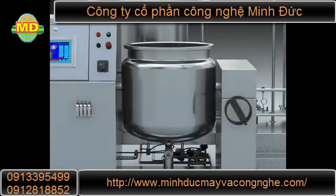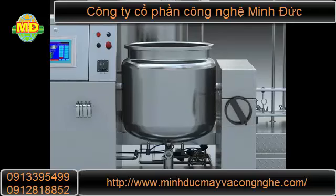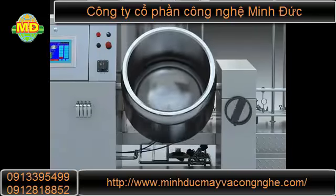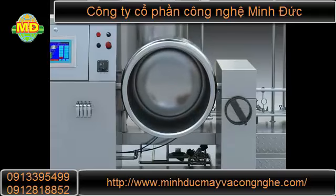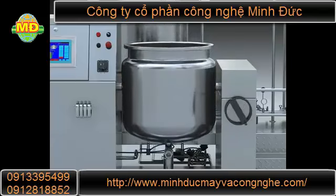4. Discharge system. It is made up of discharge handwheel, worm screw, worm wheel. When the emulsifier gets to the upper limit, forward swing the discharge handwheel until the tank leans to the point that the upper is lower than the bottom discharge limit. And then reverse swing the discharge handwheel, and the tank will reset to the normal state.